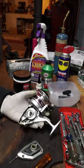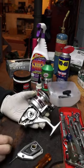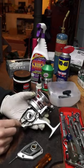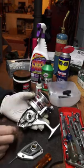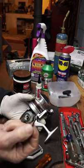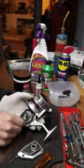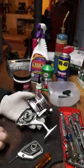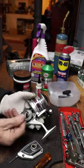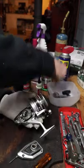The side plate then shows you the gear assemblies. In this case, it's a pretty simple gear setup. It has the main gear. It has a connector for the main shaft, and that main shaft connector will drive the spool up and down during rotation. There's a center pin that releases the carrier. You remove that, and then you remove the carrier behind that. I always put that off to the side for orientation, even though most of these seem to be symmetrical. I put that down so that I know that's the top of the assembly.